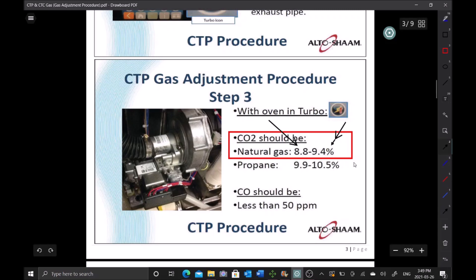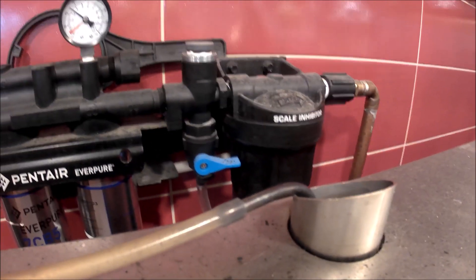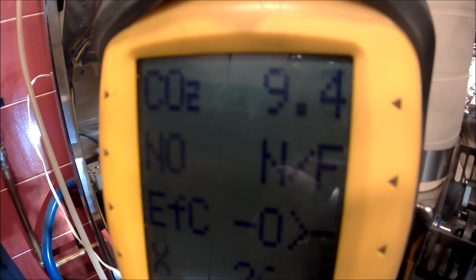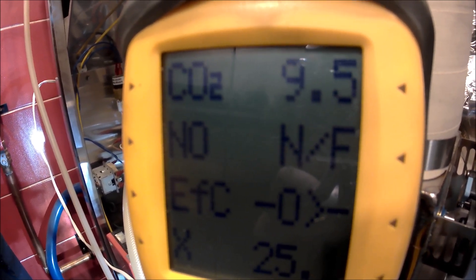We'll put a magnet in the door and do our CO2 calibration. My feeling is we're going to be high on this one. When the unit is running, insert the probe into the heat exchanger exhaust pipe — not during combustion or you'll get a high CO reading. We're looking for 8.8%, and 9.4% is the acceptable maximum but in my experience that causes a rumble. Right now we're reading 9.4 to 9.5% — definitely too high and this will need to be adjusted.